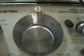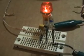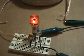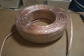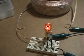So there you go — this is a basic way to tune for resonance while consuming the least amount of amps. The way to do it is to have an assortment of capacitors to test. Every time you put in a lower capacitor value, you'll need a higher frequency. If you put in a bigger capacitor value, you'll need to go down in frequency. More wire in the coil also means lower frequencies. I hope this is helpful — thank you for watching, bye now.